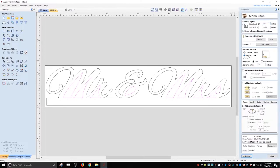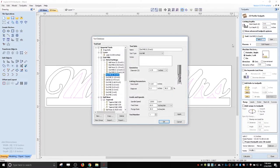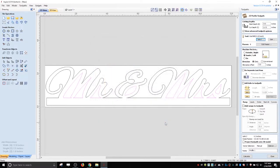We're going to do the inside of these. We're going to use a 1/4 inch end mill. 60s good. It's actually sign foam, so I could probably go a lot faster, but I can bump that up in Mach 3 right there at the machine. So I don't really have to mess with this too much. Okay. Actually, but this one I will change here.